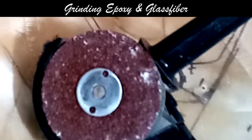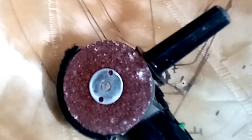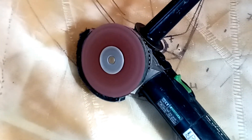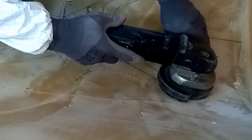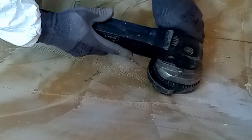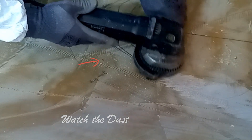To make a good connection we need to sand or grind the already existing glass fiber, and for that we use this one-of-a-kind tool. It's not a normal grinder — the brush moves if you move the handle and it runs on a very low speed but electronically controls the RPMs, so if you push harder it doesn't slow down. And it's connected to my vacuum cleaner, so on a low speed but with power on the blade, I can grind with the brush in the right position without generating those white clouds of dust.